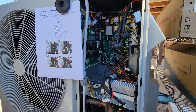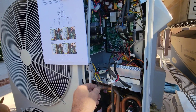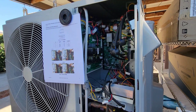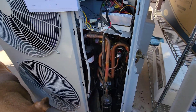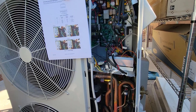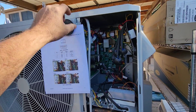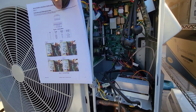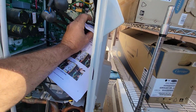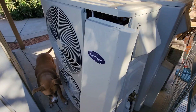I've seen stuff that was simple — like a 0 to 15 volt reference going into an inverter board that was just your speed request and it just did it. If that was possible, I would just leave this in there, run that compressor — that would be awesome. But I don't think that's going to happen. So it's probably going to be plan A. Just some stuff to think about. If anybody's watching and knows a little more about those, maybe they'll chime in. It's usually not the kind of thing HVAC techs think about — I'm one of the few freaks that probably does.